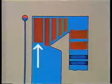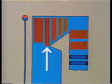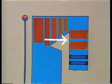There are many names for superheaters based on the way they absorb heat, their location in the boiler, and their tube arrangement. Superheater names will vary from plant to plant, but we'll cover some typical ones. We've already talked about one type, the radiant superheater. Now we'll discuss some others: the platen, pendant, and horizontal superheaters. We'll take them as a group because their construction and kinds of problems are very similar. We'll include reheaters here for the same reason.